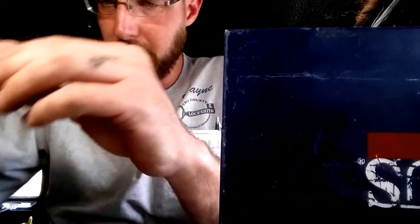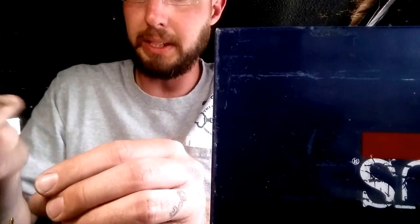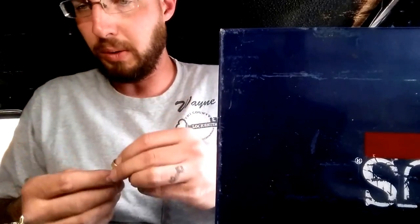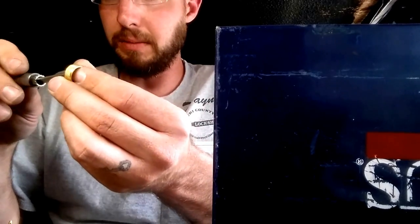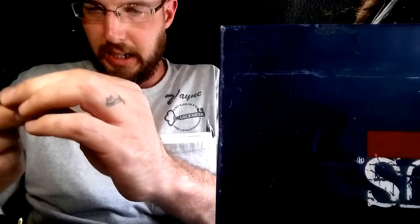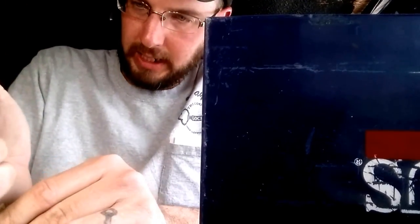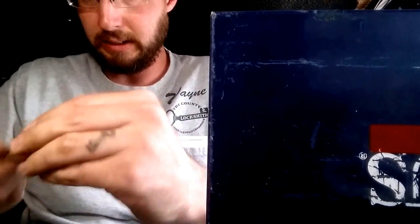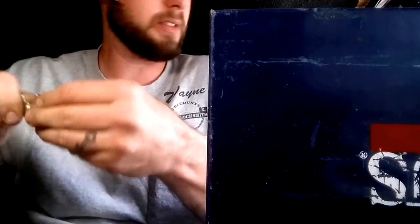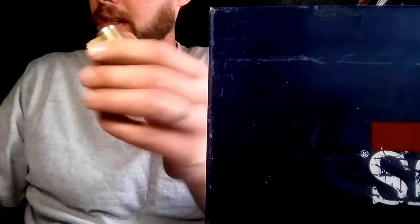And then this one is actually being converted. All right, so this is being converted from a key and knob cylinder to a deadbolt cylinder. So we will just simply install the deadbolt cylinder tailpiece with the deadbolt ring in there and go ahead and tighten that up. You tighten and back off one. See what that does with our key. If that's nice and smooth, then it's nice and smooth. Give it another shot of dry lube since it's brand new.